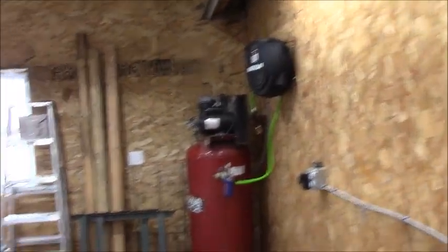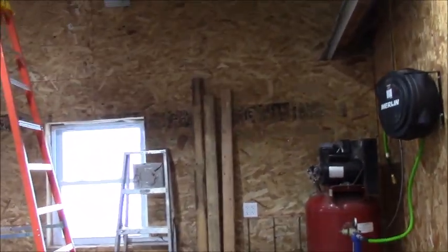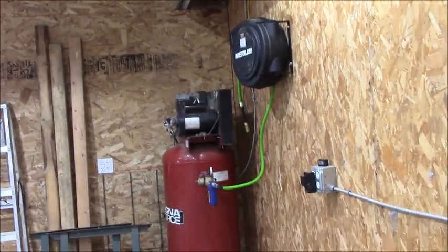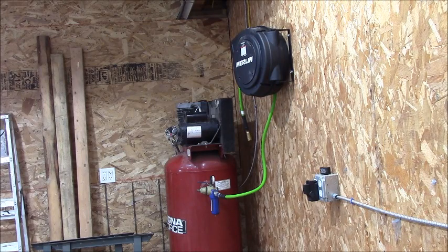So that's the point of that. All right. Got the furnace running now. I found out that when it's windy, it blows the flame out. So I ordered a different kind of chimney cap for it. And I got a couple of pipes that I can make a 90 out of, so I can turn the pipe up and put a regular mushroom cap on it and see if that helps stop the wind from blowing. Because the thing that's out there now is just like a funnel that points straight into the wind. And of course, it's facing west, and that's where we get all the wind.